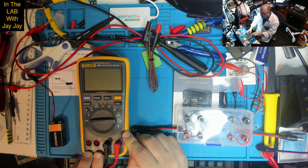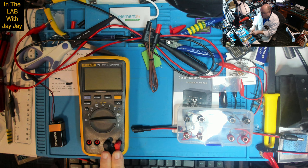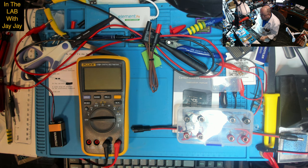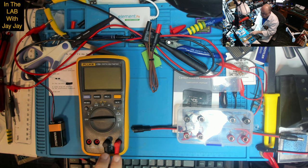When using the current measuring facilities, you're essentially introducing a short circuit between the two probes. So when using the voltage probes it's high impedance — around 10 megaohms. When using the current probes it's essentially no resistance, just a short circuit. Use the right ports for current, and the voltage ports for everything else.